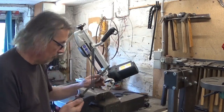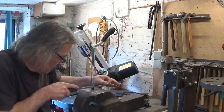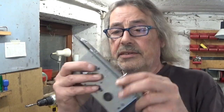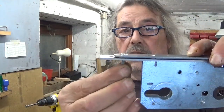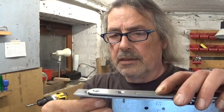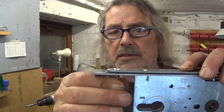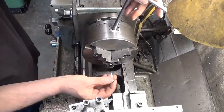And filing. Primitive. My brand new backplate here seems to fit more or less, so that's a good thing. And the little bolts I want to use, they also fit in the holes, but the heads are straight and this here is a countersink kind of thing at, I think, 60 degrees. So I will give these little bolts a little touch of lathe.